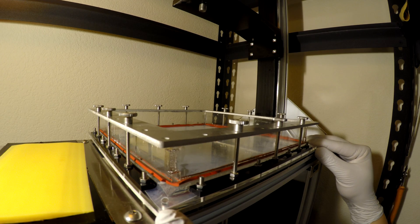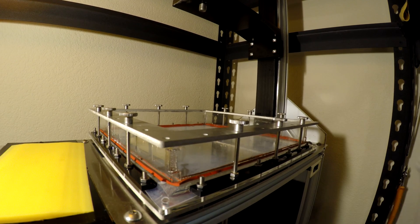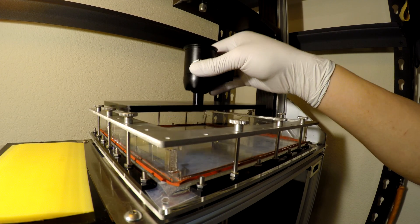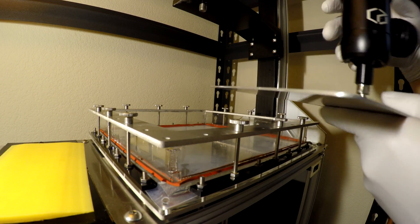This is somewhat similar in overall concept to the vat that T-Dixon designed. Now I'm going to install it — this is a bit of a challenge. I like to print big. If you were printing small and using the small build plate you could use it right off the bat, but I'm a big-sized printer and I want to print with the maximum area available. Since our build plates are designed for 190 millimeters, they don't fit into this vat, so I cut a sloped build plate at 170 millimeters that fits here nicely.